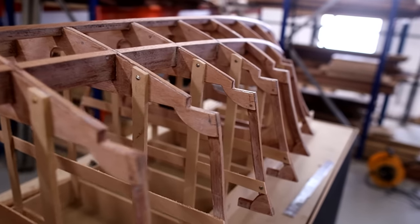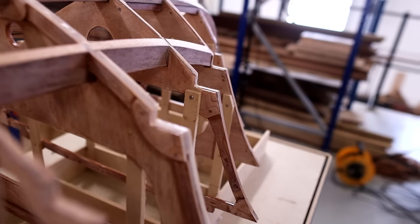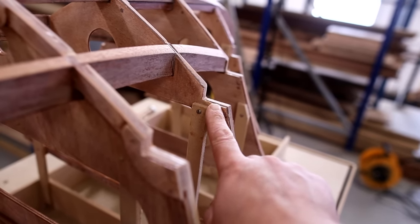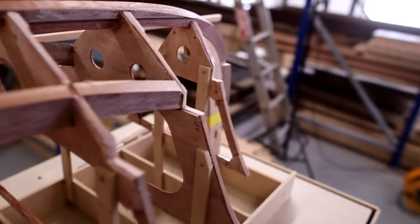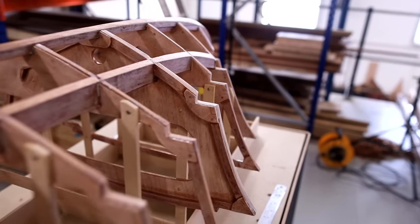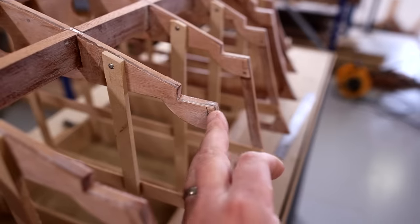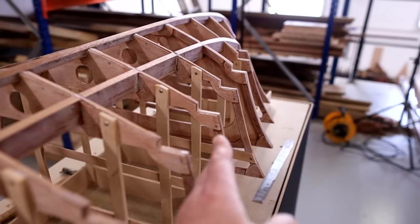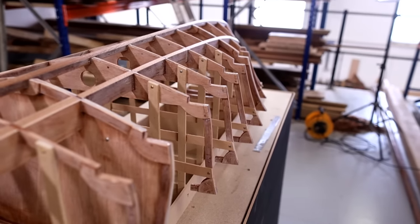You can see those notches then marked out all the way throughout the boat and how they vary. The angle gets steeper as you come forward, and this timber is essentially coming up slightly higher because you need more material to get this inner corner in the right place. So there's going to be a higher bevel angle on that face as we come forward, right up to frame one. My advice is to use these as rough guidance — don't cut right over the line, leave the line in place as your reference guide, cut inside it, leave a bit of material there. There is really no substitute for just springing a timber in here and doing a double check that everything looks fair.